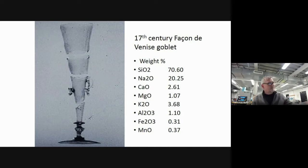And that's kind of the end of the first thing, but I just want to read one thing to you. This is out of a book from 1661, and I think it's wonderful what you find. It says here, and forgive me, it's not going to sound great, but after 18 hours, this stuff will be purified, which cast into water, purify it again in the furnace, make a proof, and if it be too clear, add 15 pound of aforesaid calcined tin. Mix well the metal many times, and at the end of one day, it becomes marvellous white, and in whiteness surpasseth any snow, then work it.